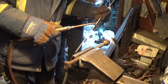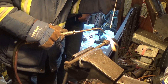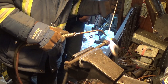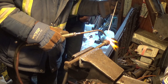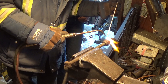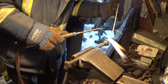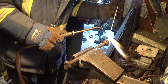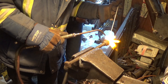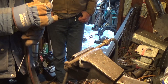What I'm using is a 3/32 inch flux-coated brazing rod. You can get them in different sizes from different welding suppliers — you can get them in 1/8 inch, I think, or down to 1/16 of an inch or something. I've got some 3/32 here, and this is kind of a nice size. There we go, we've got a good start there on the one side.